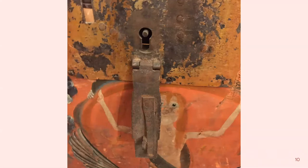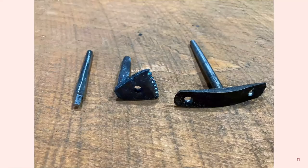This slide shows the keyhole with the pin. The pin is a mechanical feature around which the key pivots, supporting the key against the pressure of the different spring-loaded pieces it contacts in the lock. It's also another layer of defense — a key that doesn't have a hole big enough can't fit over that pin. On some locks the pin is really large, the wall of the tubular key is slim, and it also gets in the way if you're trying to pick the lock. The next slide shows three different types of pins: the one on the left is a simple filed tenon; the middle one is bent into an L-shape and takes a rivet for more support; the one on the far right has two holes for rivets and gives the best support, centered in the ward box.